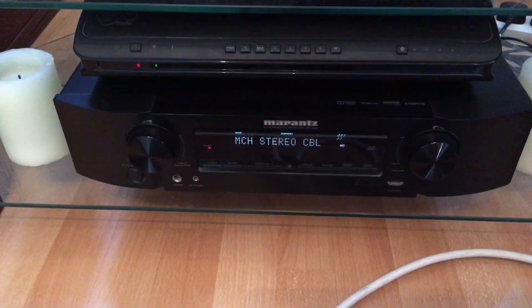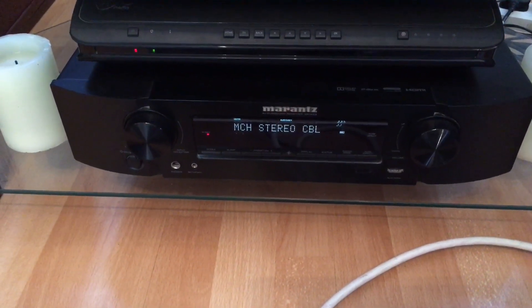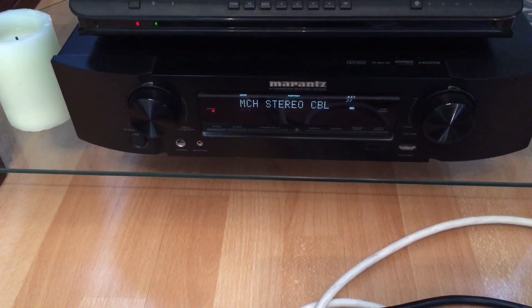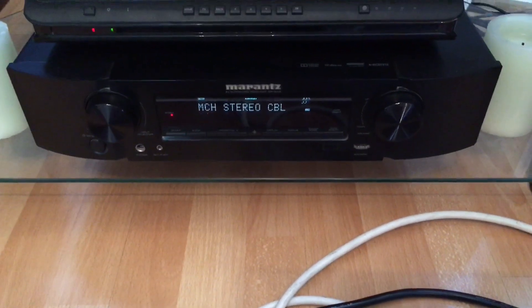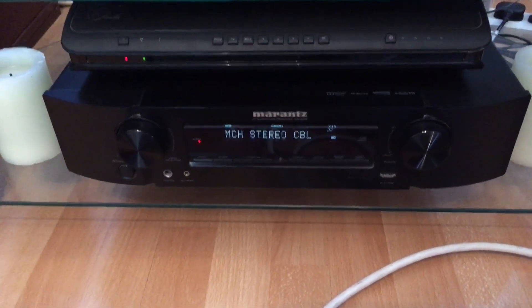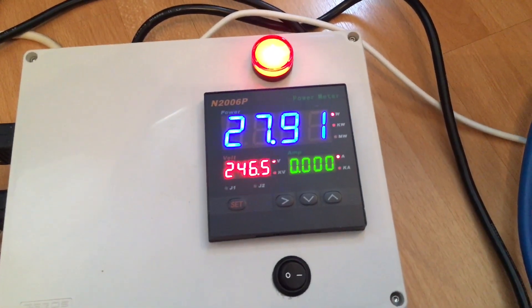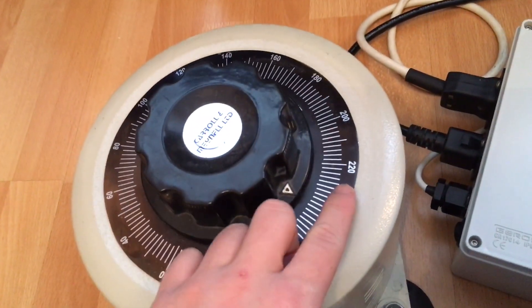Then I noticed a pattern — it was happening when someone was in the shower. Our electric shower is 10,000 watts, and obviously the voltage does drop quite a bit when it's on, but it shouldn't make a difference surely. Anyway, I've got an experiment here — currently showing 246 volts, which is roughly what our mains normally is. I've got a variac set to 240 so you can see what happens when I load it.